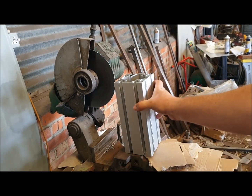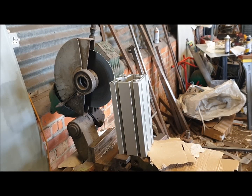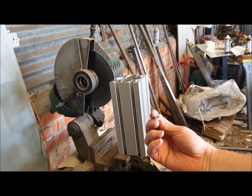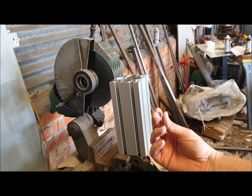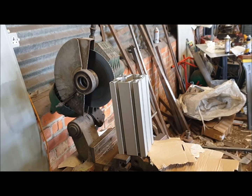The first stage is to take this 100 by 100 profile that you get from Kinetic — the link will be in the description — and these little self-tapping threaded inserts. You need to fit eight per profile; that profile length is 250 millimeters, and I'll put the proper details in the description.